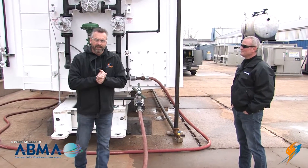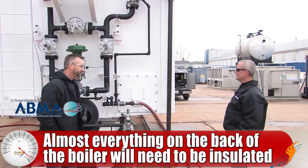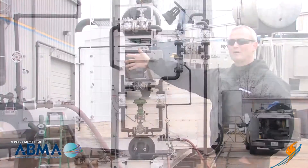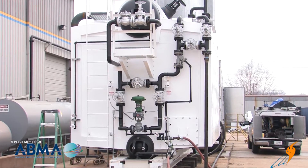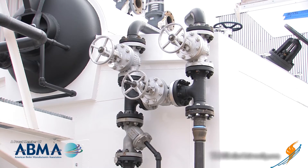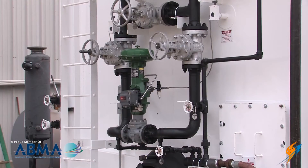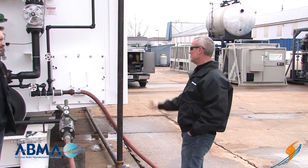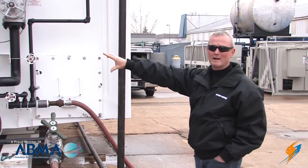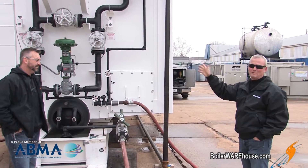We've moved to the back of the boiler. Let's talk about the feed water. Pretty much everything back here ought to be insulated. The feed water lines — if the boiler's running you're going to have water going through them, except in a low load condition when the feed water valve closes. But you still need to heat trace and insulate all that. If the boiler goes down, same issue — all this will freeze up. This is the main feed water line coming in. Those pipes up there are going to the economizer — all the way to the economizer, all of that needs to be heat traced and insulated. All this pipe in here, the bypass, because that's all dead leg piping — all the drains, the blow down lines — it all has to be heat traced and insulated. The surface blow down line is on the other side. If somebody comes along and shuts that valve off, that's going to freeze up and bust. Every line that has water in it or going through it — all of it has to be heat traced and insulated.